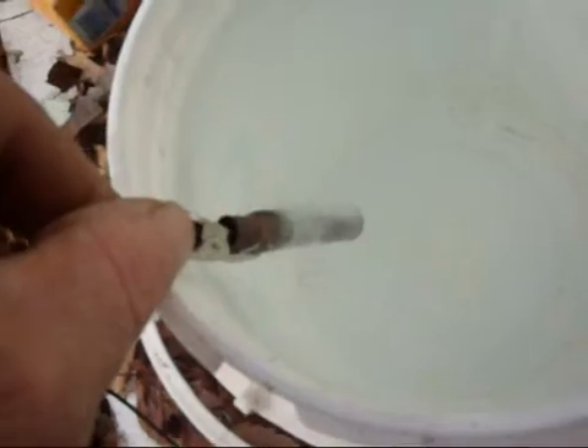If I bring them farther apart, it slows down a little because of the distance. I put the electrolyte in so it makes the water more conductive. You see that side how it's turning green? It's floating off right there — it's actually oxidizing the copper that's in the brass. I don't know if maybe that's a good way to get copper out of brass. But yeah, that's just what it should look like. Brass, like any metal, has a little resistance, and 12 volts is really high — it should be around 2 volts.